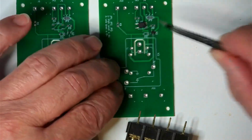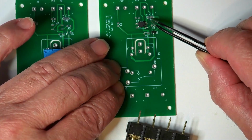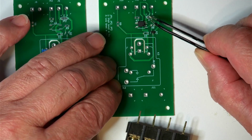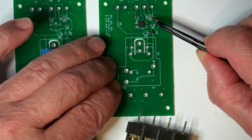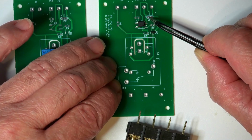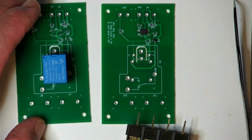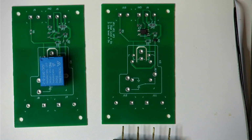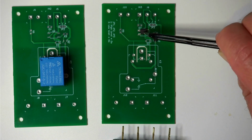We're going to do some soldering under the microscope, and this here is the jumper. We shouldn't have to do anything. It should be connected so that it is positive, and as you can see, the negative symbol there. If I cut this open and solder a blob of solder on there, then it'll be negative logic, so it will respond to 0 volts instead of 5 volts input, or 3.3 volts it should work with.